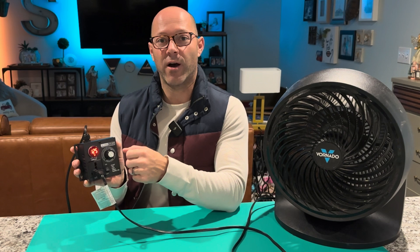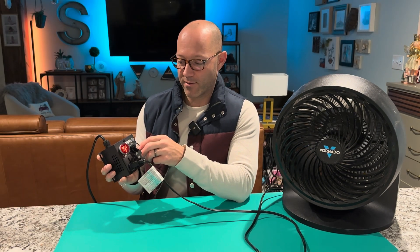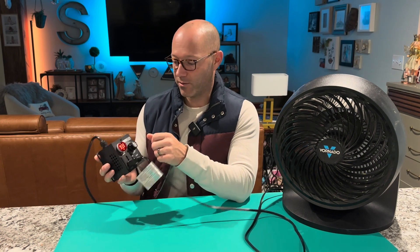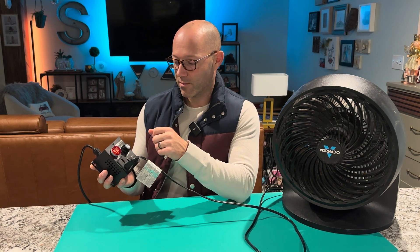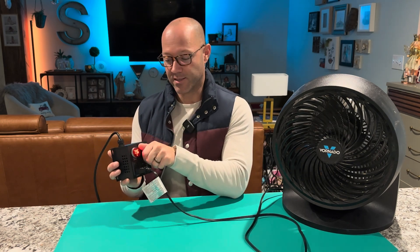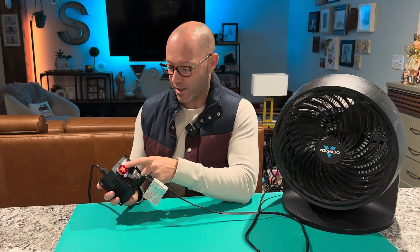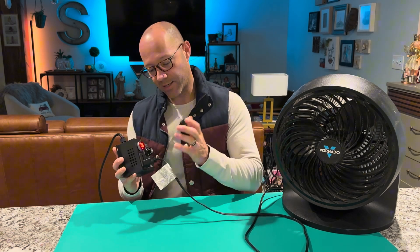So it's pulling 125 volts at full. And now we're at about 95, 93 volts. It's definitely controlling the voltage going in there — it's not letting any spikes through. It's keeping it really consistent, and I like it.